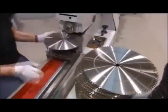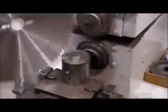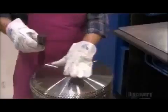They feed each disc to rollers that press grooves onto both sides. These grooves are tensioning rings that will keep the blade from vibrating while cutting. Without these grooves, the circular blade wouldn't cut straight.